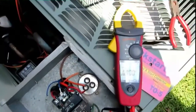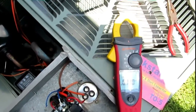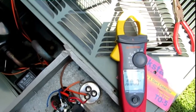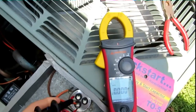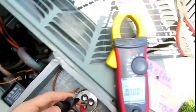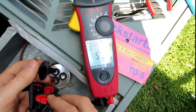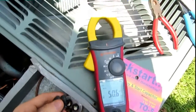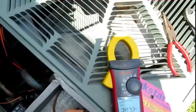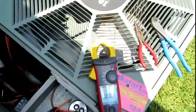Okay guys, I'm going to try this a little different. I've always pulled all the wires off when testing the cap, but I've seen Fritz do it — leave the commons on and just take the Herm and the fan off. I'm going to see for myself if my readings are the same. Common and Herm — 50.6, exactly the same. Fan — 3.07, exactly the same. So that's good to know. That means less wires to take off every time you test one.